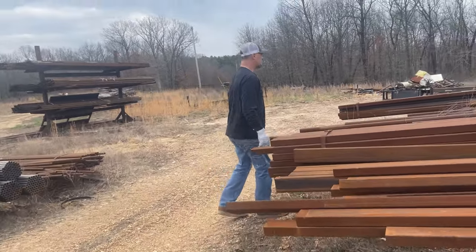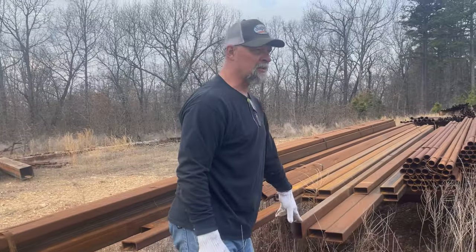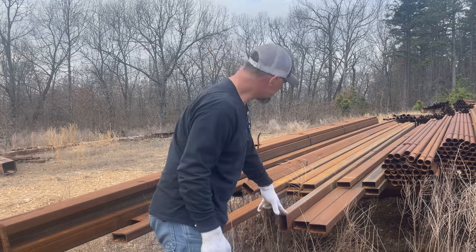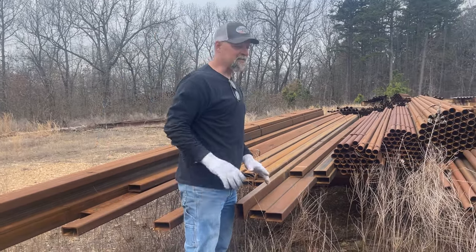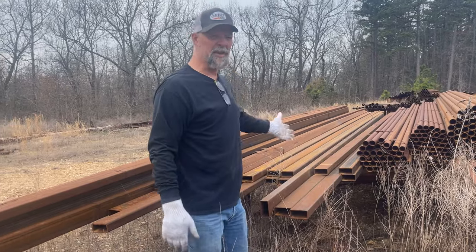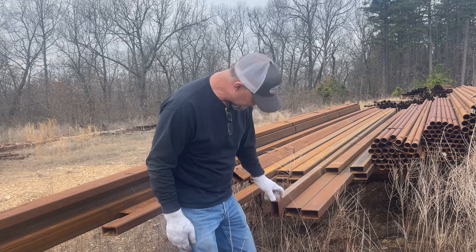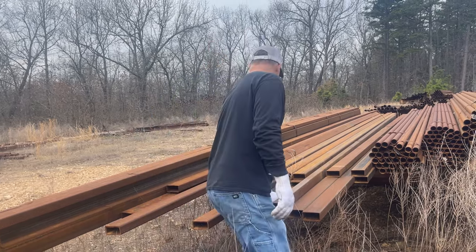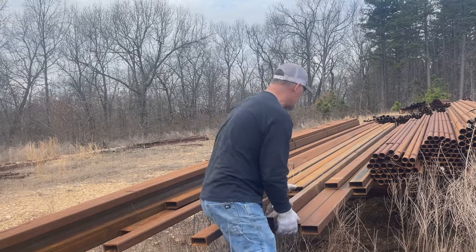So this over here is the heavier material. We're going to make the sled for Ken Williams' trailer out of this material. This one here's got a seam in it — that's not going to hurt us on a sled for a smoker, we can probably cut that out anyway. So I'm probably going to get two sticks of this right here. This is about 11 gauge. There's some heavier stuff here, like seven gauge — that's too heavy for what we're doing.